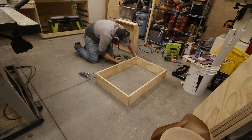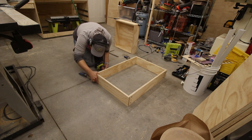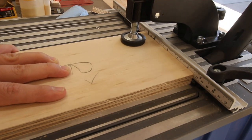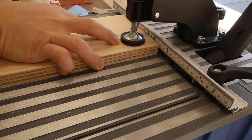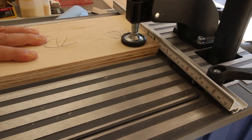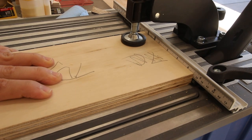I built some of the larger drawers down on the ground, to reference the flat garage floor as a common edge, then used this edge as the bottom of my drawers when gluing the bottom panel on, so that there were no gaps between the bottom and walls once the drawers were assembled. One thing I'll note: when drilling the pocket holes for the drawers, make sure that the nicer face of the board is facing up. The reason for this is that when the drawers are complete and installed, the face of the boards that will get the most visibility will be the inside of the drawers themselves. I missed this on a few of the drawers, so there are a few drawer bottoms with big voids that were present on the ugly side of the plywood.